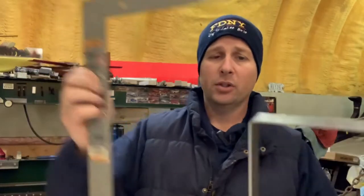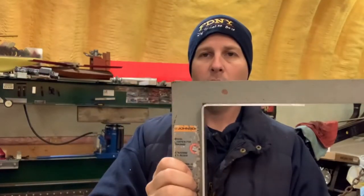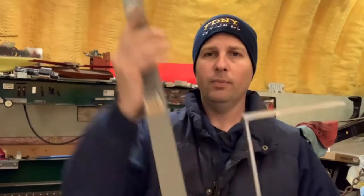Unfortunately, because this is such a narrow piece, it's pretty easy to put too much force on it, which I did. I slightly overbent it and I cracked the back. But this is a test piece, so that's okay — I was able to straighten it back out again. We've got a good 90 degree bend there. When I bend the full size parts, it won't be nearly as much of a concern because the same amount of force will be spread over a much larger area, so it's a lot less likely to get overbent.